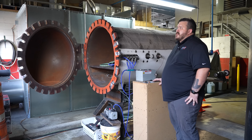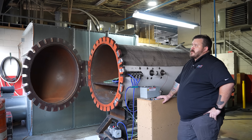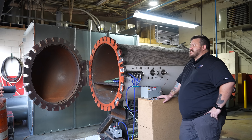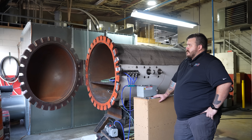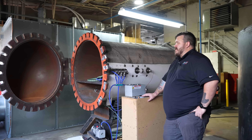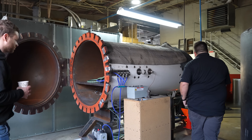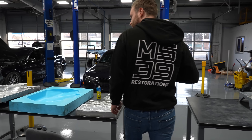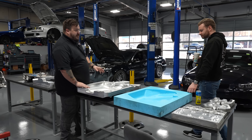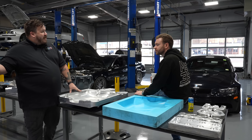This consolidation really matters and makes a big difference in the finished part. This is what sets us apart from a lot of other shops — most shops our size in the United States don't have anything like this. Going back to the molds: we started using the billet molds. We had another issue with the S65 plenums — when I first started doing these, I wanted to do them all in one shot, and these molds are actually designed for that. You can see the locating lugs here that match up with the bottom.